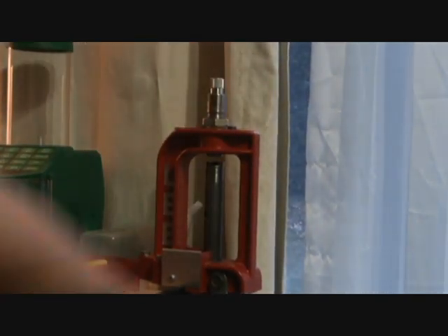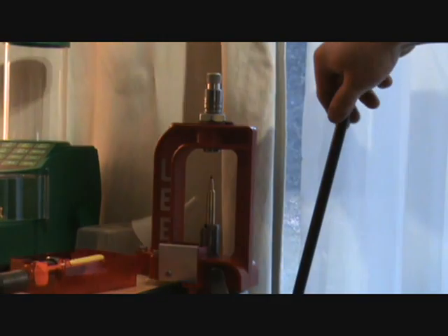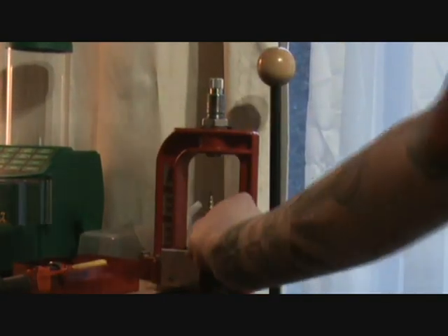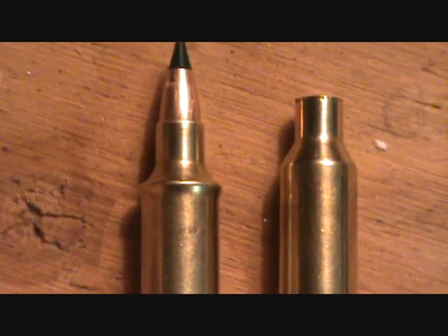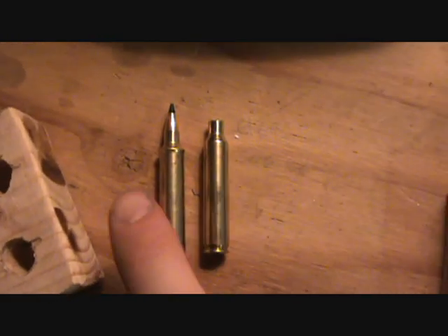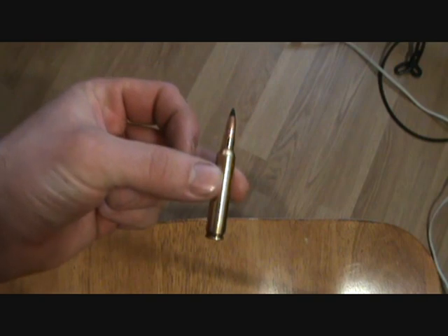For the sake of demonstration, I've got a dummy casing with a bullet seated in it and no primer. That's what you don't want. When we put these two side by side you can really see the problem - there's a blown out shoulder on that one. So this one is touching the shell holder with a quarter extra turn, while this one is just snug on the casing. Remember that.